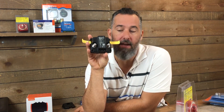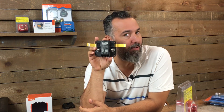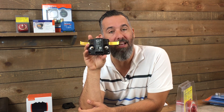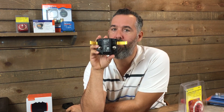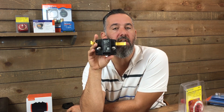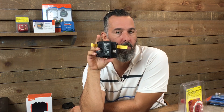So the question from Wayne is: where do I connect this? Do I connect these posts to the unswitched or switched distribution? If you look at my diagrams on my website, you'll notice that battery combiners always have to be connected to the unswitched side. Unswitched means a direct connection to the battery — even when the battery switch is off, this device is always connected to the battery. Ignore my advice about unswitched and switched distribution at your peril. This absolutely needs to be connected to the positive post unswitched of both battery banks. It can never, ever, ever be switched.